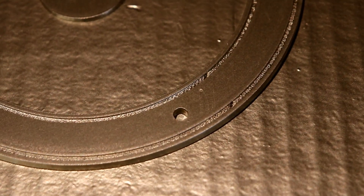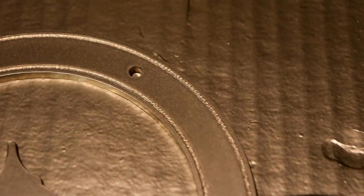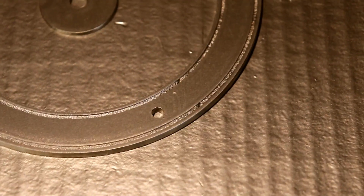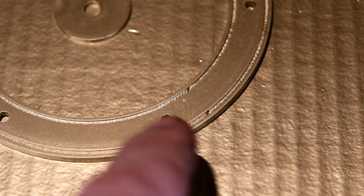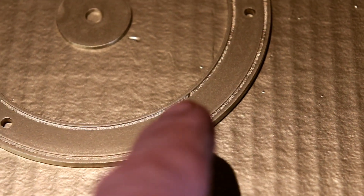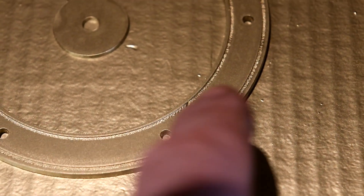That's lovely — no blemishes on that after a first coat. But there's a big blob there on the outer window frame and another speck somewhere over there, so I'm going to have to get the 1000 grade sandpaper — I'm so pleased I ended up getting it. With 400 grade it's too coarse and you end up sanding off lots of paint and leaving scratches that are big enough to be picked up after you've sprayed another coat on. But with 1000 grade you can just sand a little lump off, spray it straight away, and there won't be any sign it ever existed.